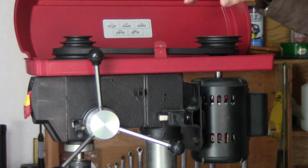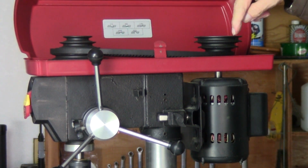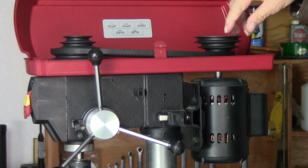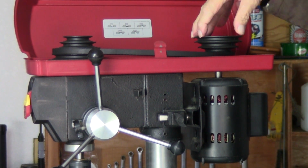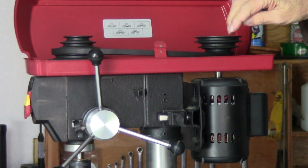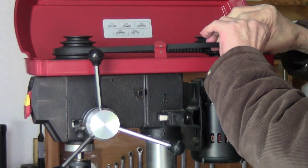From this point, you're going to pull the motor back. Well, first of all, I'm sorry. From this point, once the belt's loose, you want to go in here and tighten up the Allen wrench on both of these. This one was loose, so I noticed as I was using it, it would stop working. I looked at the top, this had fallen down and the belt fell off. So tighten the Allen wrench on both of these snug, but make sure they're flat across when you're adjusting the height of this. Make sure they're level across so the belt is even all the way across.